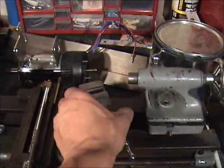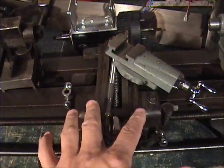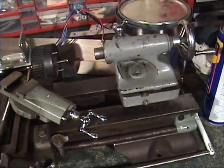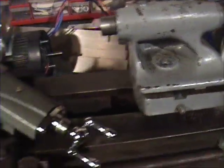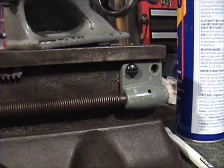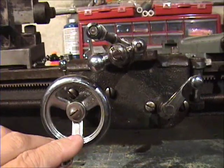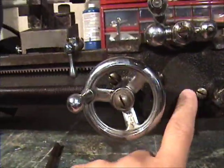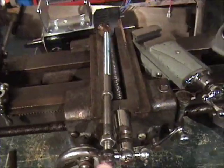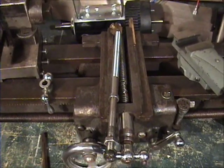Anyway, that's what I got so far. That might be called a compound thing here. And what I need now is a cross slide, so I'll have to go look those parts up. I'm digging this though — all the parts that I got from this guy are in such great shape. I'm just excited it looks like I might be able to get this thing going. With this thing back on the lead screw — remember how I said it was smooth? Yeah, it pulls that lead screw out of the way of the half nut in there. This is really nice, smooth, no slop. So hopefully I can get this lathe going.